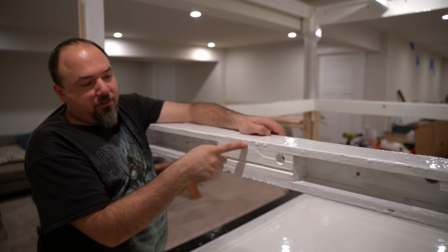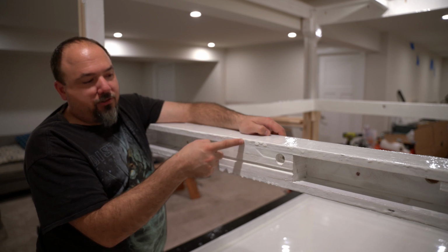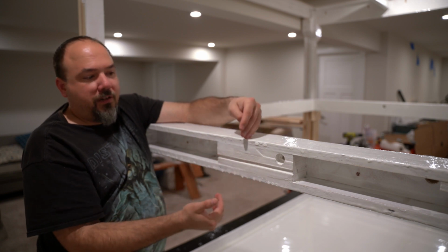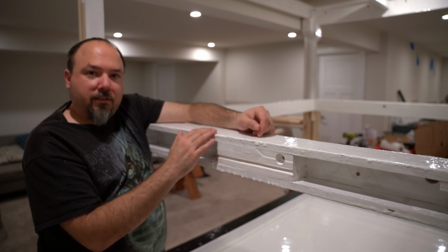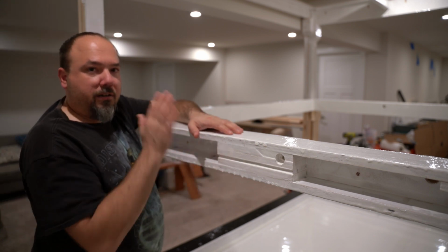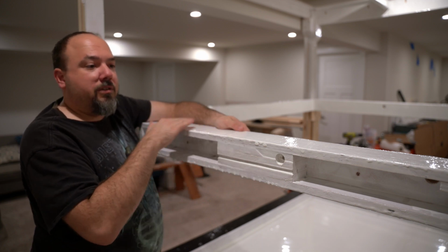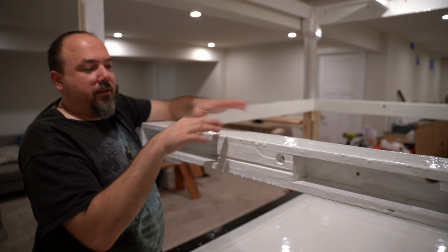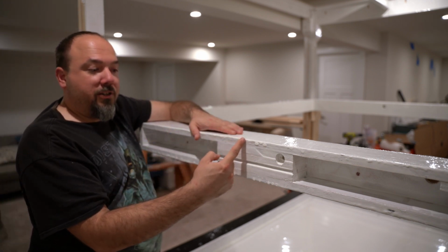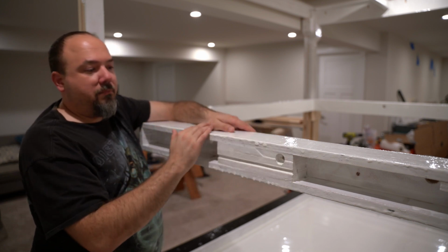You can actually still see it a little bit here through the pond shield, there's a little strip of wood, and that's because after I cut through 2/3 of it, I wedged it to straighten the beam out. In fact, I placed it up here on its little temp holders I had at the time, so that I could make sure with this beam and its wedge in here, it would sit nice and level. So I did have to put the wood wedge in just a little bit more to hold it level, so I pulled that sag out of the beam all the way.